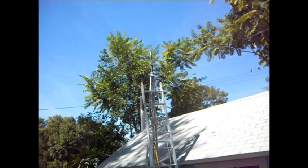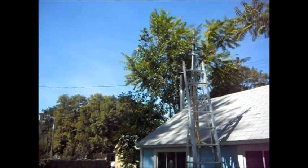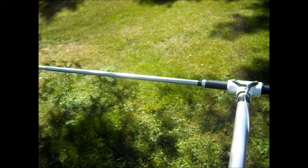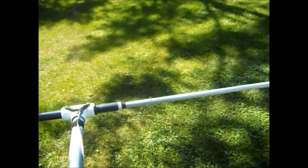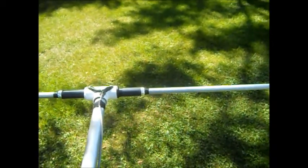We got our bracket up there ready. We're going to relocate the 2-meter antenna because we want this up in the air. It's not going to matter so much that the ground side is going to be near the mast, but the hot side will be above the mast. When I am done, I have to raise that piece up, but it will be above the mast.